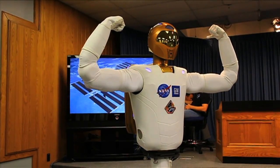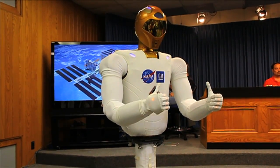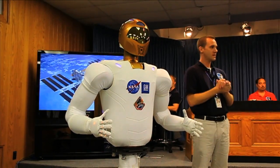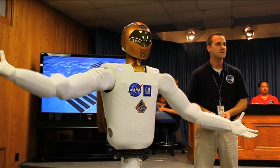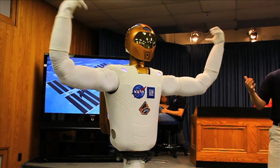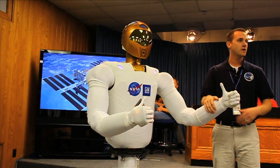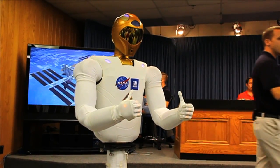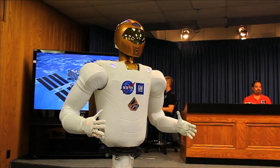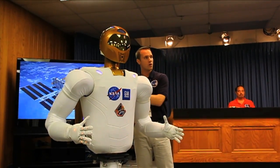If I got hit with that with some significant velocity, if I was up against a hard object, it's gonna hurt — it could theoretically break a bone. But having solved that, I'm gonna stand right here and continue giving the presentation. What you're gonna see is I can stop the action of the manipulator just effortlessly. And so that allows us to interact with the robot shoulder to shoulder, elbow to elbow while we're doing our assembly tasks, without too much concern about the robot bumping into us. When you're working next to someone, it is commonplace to bump into that person, because we're big, compliant, floppy systems. We need to keep that same sort of idea as we build robots that interact with people.